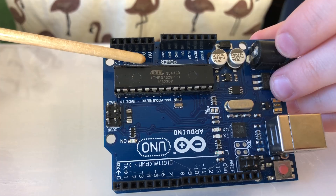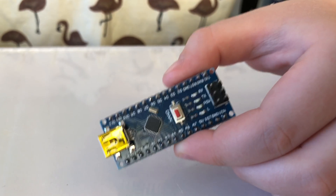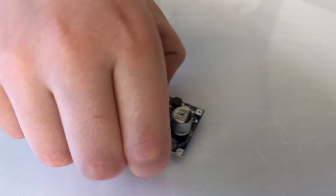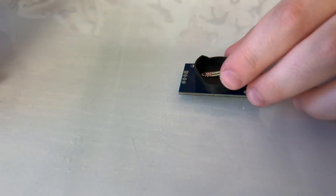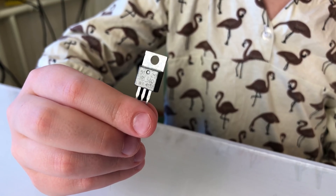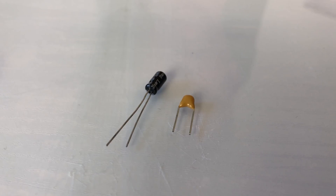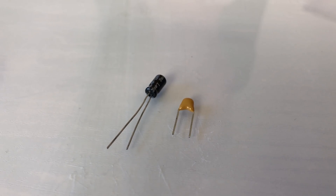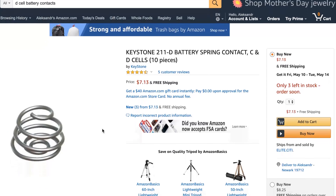A standalone ATmega 328p microcontroller — or you can strip your Arduino to make it less power hungry. I used the same Arduino. A 5-amp boost converter for the motor, like the LM2587. A DS3231 real-time clock module with hardware alarms. An IRL540N MOSFET — I insist on the IRL version because it has a lower gate threshold voltage, needed to turn off the boost converter when it's not in use. Capacitors help with stable voltage; I use two — 1 microfarad and 10 microfarads. Battery contacts; I use a steel wire for this purpose. Maybe I'll change the model later to fit the most commonly used ones. All links to the parts are in the description.